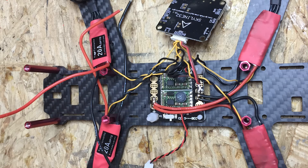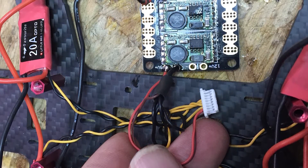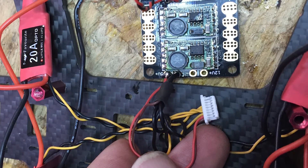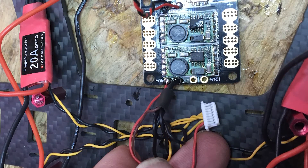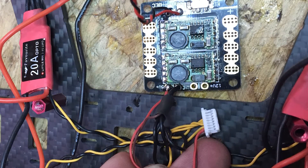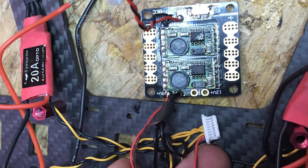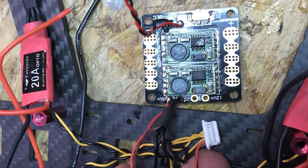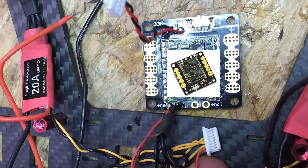On the negative wire, you can go on the forums and see numerous debates about whether you should have the negative cut connected or not. I figured the best way would be to have it connected. So what I did is I soldered all the negative wires together along with the five-volt negative off the power distribution board, because that negative voltage would also go into the signal ports. So that's a common ground — the negatives off all four speed controllers soldered into the negative off the number one pin, and that little bundle soldered into the five-volt negative spot on our power distribution board.